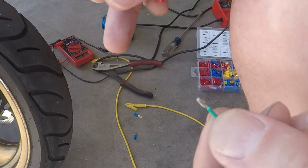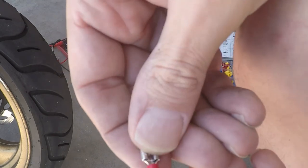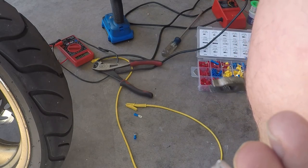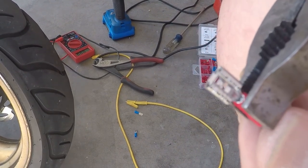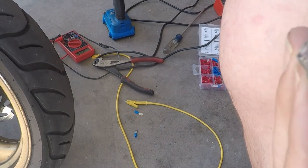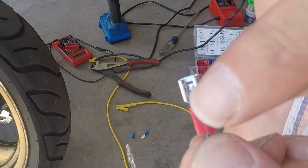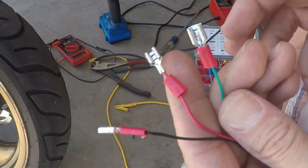What I'm doing is curling this wire over and sticking this female connector on it, then once I get it on there, crimping it down. After crimping those on, I'm going to solder right down in here on all of these to make the connections good.